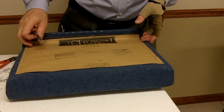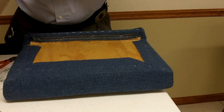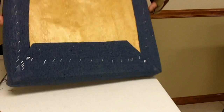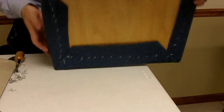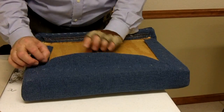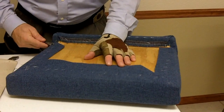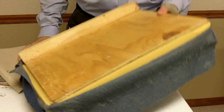They used to use black cambric — a black fabric — on the bottom of chairs. In the old days when a chair was stuffed with horse hair, it kept the dust from coming out, so it was called the dust cover. It keeps fabric pieces and threads from hanging off, but other than that it's not an important piece. We will use some black fabric to cover it instead of cardboard — just staple, staple, staple. So that's the seat stripped.